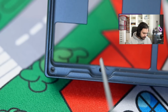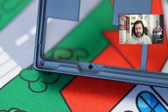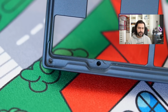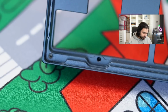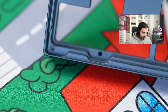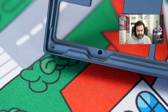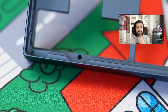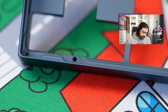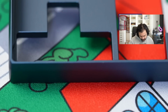And we see that there is a machined area outside of the plate mounting points. Why is this? There are probably very good reasons, but we'll get there. And then we've got our actual case screw points. But then over here, you guys see that? You see that little radius in the machining? And also here. So there's a lot going on. This is accomplishing a few things. It's handling alignment, acoustics, assembly, and plate mounting. And overall, it's doing it pretty well.